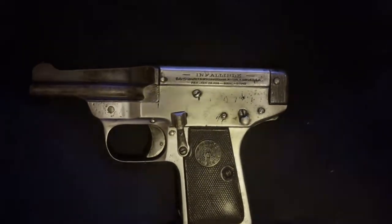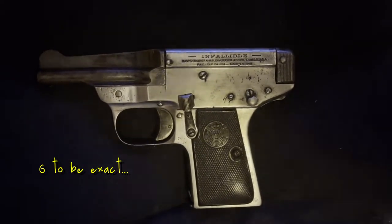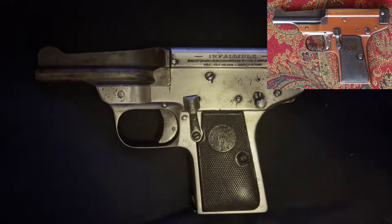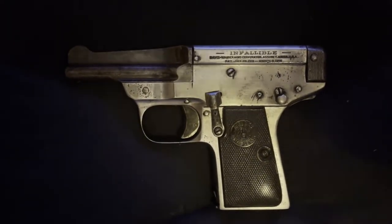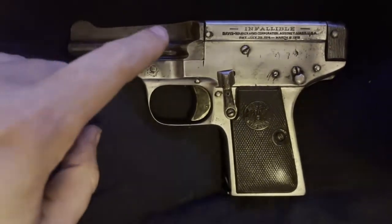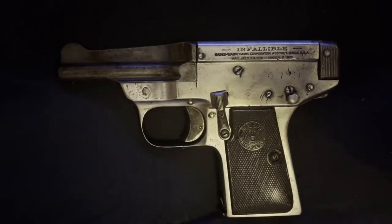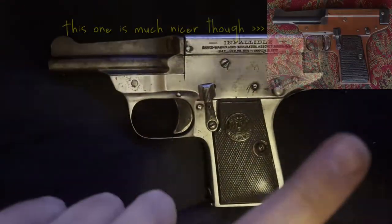Okay, so it has been several hours — many hours, actually; I think about six since I started this. What do you think? Kind of looks like that picture from earlier, right? Not too terrible for a 106-year-old gun. This is as far as I can take it — it's all clean. I left the barrel, the trigger, safety, and striker block in their original patinaed blued finish, but the frame I went back to the white, just like that reference picture.